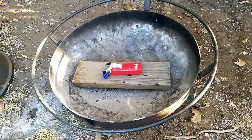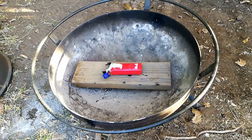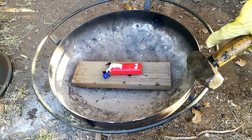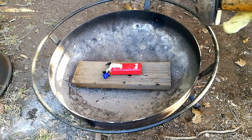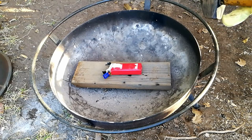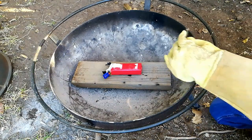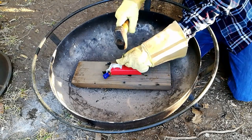I've got the battery set up outside in a fireproof location. Before I do this experiment, I'd like to preface it by saying this is not an experiment you necessarily want to try at home. I'm using all the correct protective equipment including a face shield and goggles. Another hazard to be aware of is that since the polymer in this battery contains fluorine, one of the products of combustion is hydrogen fluoride, which can be quite a noxious gas among other organic solvent gases. So be cognizant of that, and if you don't know exactly what you're doing you probably don't want to try this at home. Without further ado, I'm going to put on my face shield and drive a nail through it.